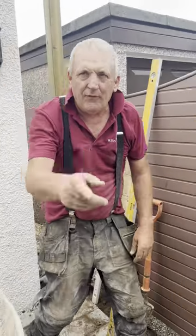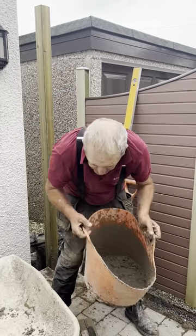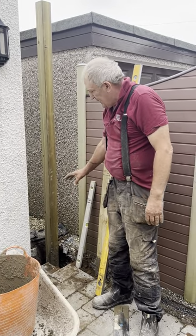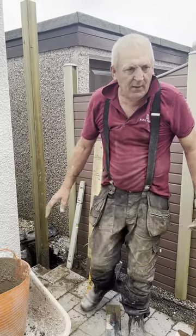So, foolishly, we've not got enough water. The water's in the garage, and I don't want to open the garage all this time. It would take me too long. But I've done the basics here, including we'll put another bucket of ballast in there. Level it up about 3-4 inches below ground level, tidy it up with chips, reinstate the mono block and everything. And that's what we do.